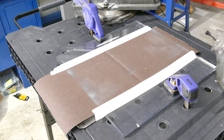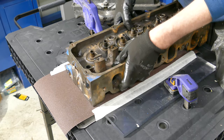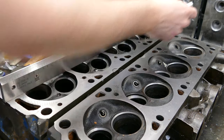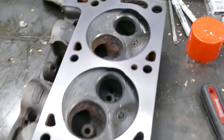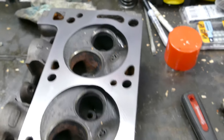I'll keep running with this just for now and then we'll get the 240-grit on it just to mirror it up and run a straight edge over it, and that should be about it. If I look at these now you can see that surface — it's got a great shine to it and it's really, really smooth to touch too, so I'm pretty happy with that.